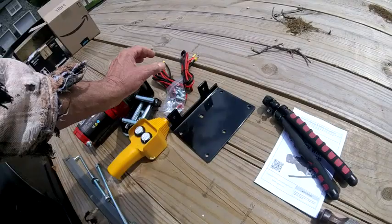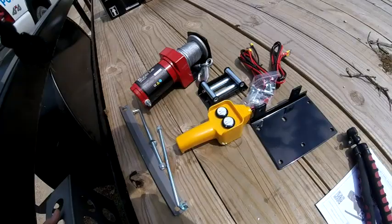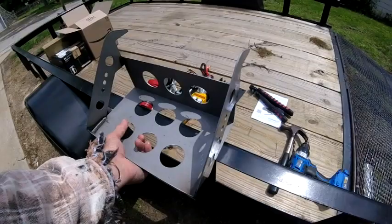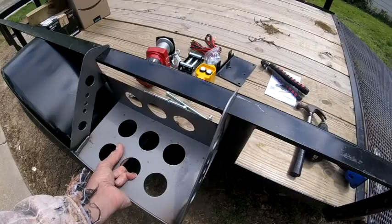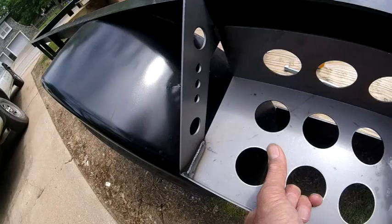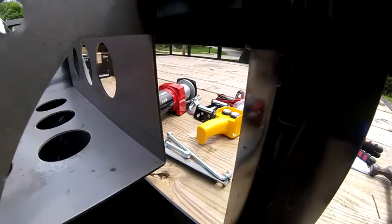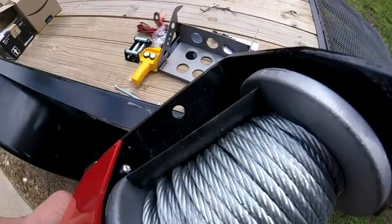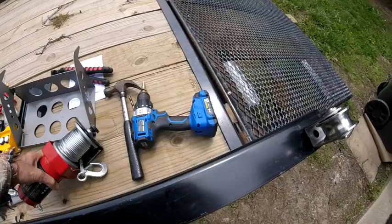It came with a bag of bolts and a big bracket, which I don't think I'm going to use — it's a piece of three-sixteenths steel, same with this mount right here, three-sixteenths. Then I bought this Welden battery tray or box — I've used one just like it on a tractor of mine where the battery box rusted out. This is going to go here, slide up against here — that's my three weld points — weld, weld, weld, and then we'll see how it acts right here.